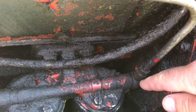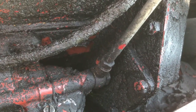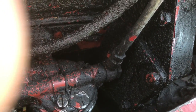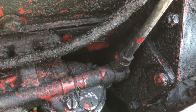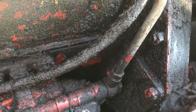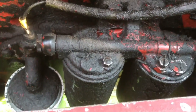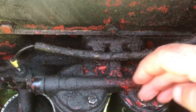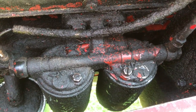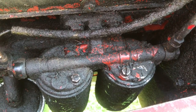I haven't taken this off to see if there's fuel flowing — I'm a little reluctant to undo this banjo bolt in case I can't get it back together again. There's also another part of the engine right here where I can get a wrench in, if you think I should take that off to see if fuel is getting that far. It kind of seems to me that if it's leaving the tank properly, it's probably getting through that pipe, so maybe my first bet would be to change the filters here. I know these are the bleed screws — I took them off just to see if fuel would come in from the tank and fill the canisters and come out by gravity. It didn't, but I'd only watched it for 10 or 15 seconds.